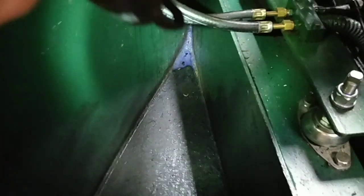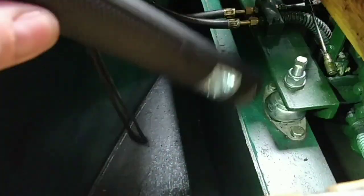Get right in that corner there, it's annoying. Just can't reach it. Another hoover out, get those bits up, and then I think I'm going to paint it. I think marks I was telling you about there, look. Brunswick green. Another one there which I've treated. Brunswick green this is, 227 is the colour. So I'm going to paint it Brunswick green again after I've grey oxided the base. I'm not grey oxiding everything. I'm just going to touch all the paint up and go straight over that paint, because these new paints now can go straight on it. It's pretty good.